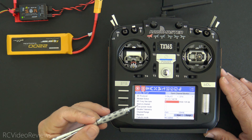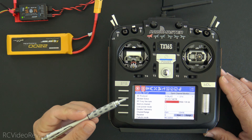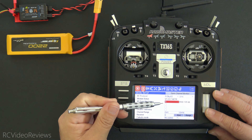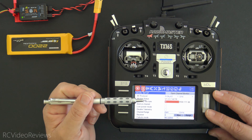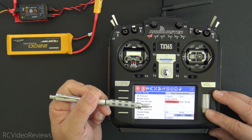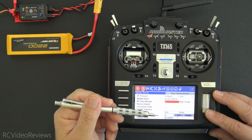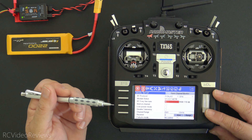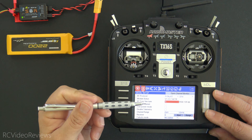The next question is: when do you perform frequency fine-tuning? The simple answer is that when you select a protocol on your radio — for example, RF protocol FrSky X2 — if frequency fine-tuning presents itself as an option, you should conduct it. The good news is that once you figure out what your fine-tuning value is for a given protocol, in my case FrSky X2, you don't have to do frequency fine-tuning again for the next FrSky X2 receiver. Once you find the value for a given protocol, you can reuse it. That's the key.